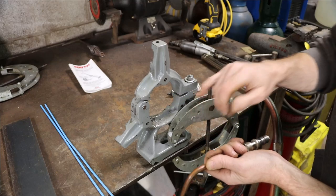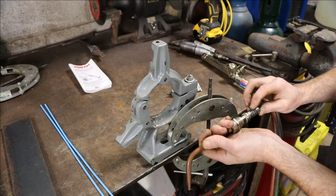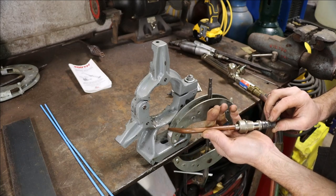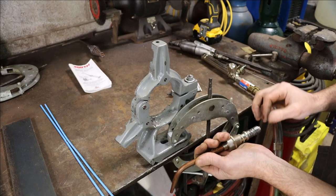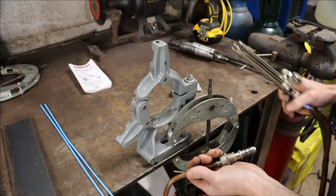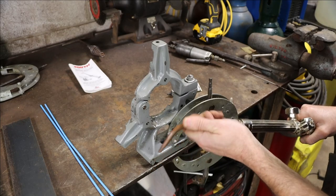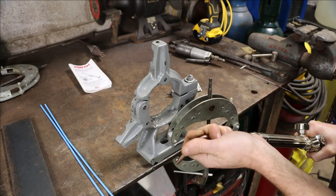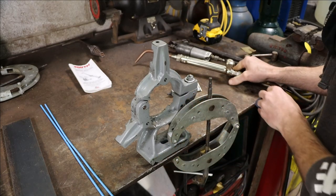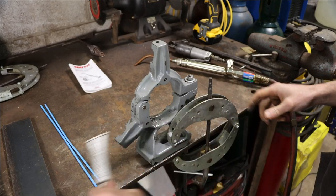So I've got the first section burred out pretty heavy there on this repair. I'm just lubricating these O-rings on this. This is an SW205 brazing tip. It's what we're going to start out with. And these O-rings are pretty sticky. This thing slides together, but this dry graphite really seems to make things slide together much nicer. Keeps them from getting all scuffed up and leaking. So let's get this torch fired up and start heating this thing up and stick it together.